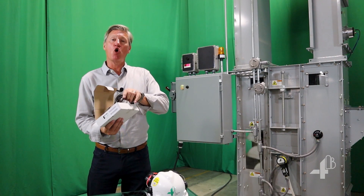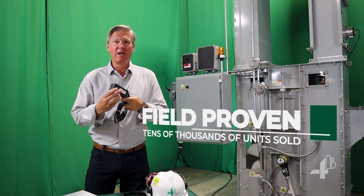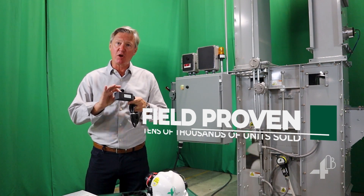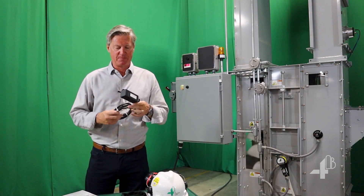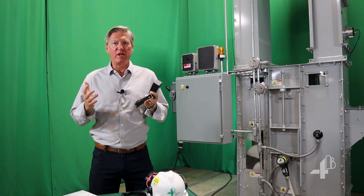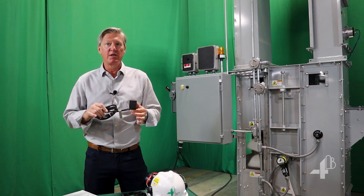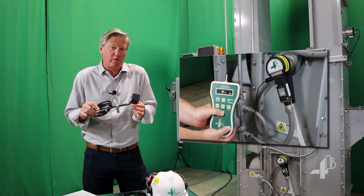This shaft slowdown or belt slip sensor is the fourth generation of the unit. It is the most popular speed monitoring device in the industry. The M800 provides three output signals to warn when a shaft falls below normal running speed, giving the user an indication of belt slip, slowdown, or other trouble with the machine.